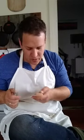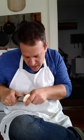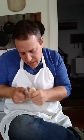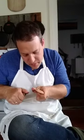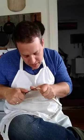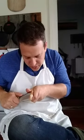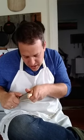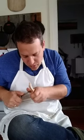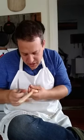All right, so now I'm going to pull up the side rim. At each stage, I about cut the side rim in half, and that's how I approach refinement while still giving myself wiggle room at each stage. I never want to get all the way to the finished dimension too early in the game, because you never know where you're going to need to adjust later on. So at each stage, as the cuts get more and more refined, I'm pulling everything into more delicacy, but I'm doing it in stages so that I can adjust things as I go.